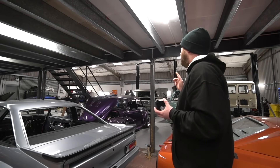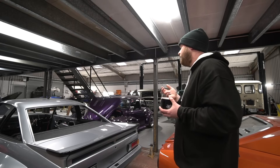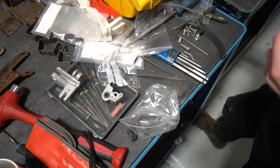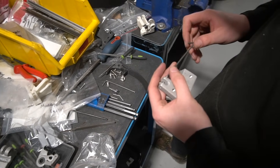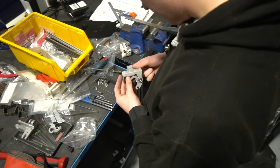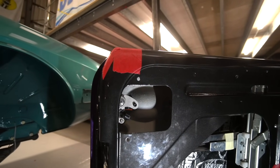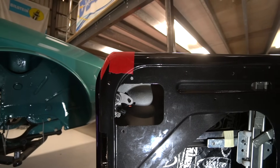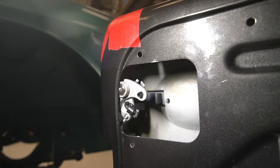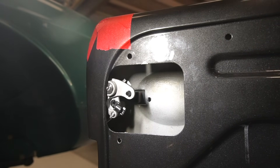Talking of CAD on the Morris - finally, the mechanisms in the doors that we've had metal 3D printed have arrived. George was able to do a mock-up assembly of those and it all looks great. That was the final thing we were waiting for before getting the exterior handles machined. They're just 3D prints at the minute, but because there's a little bit of play and inaccuracy in 3D print prototypes, we wanted the actual metal components forming all the latch pivoting mechanisms together with all the bushes, so we could try the handle again and confirm the alignment and angle before machining. We're now pulling the trigger on machining those handles - hopefully early next week.